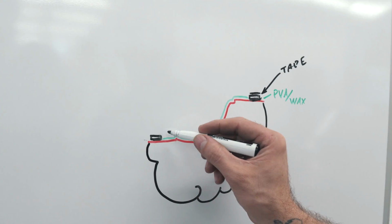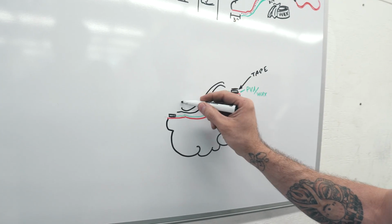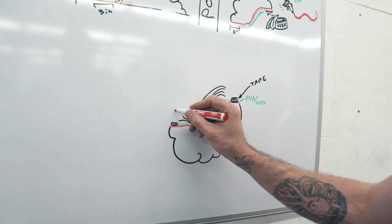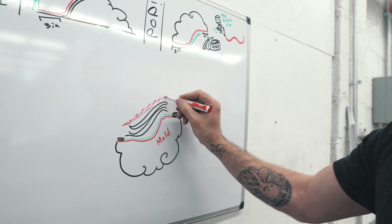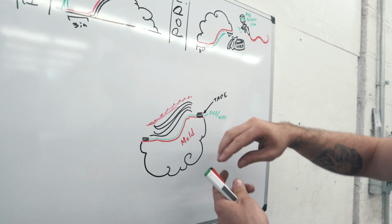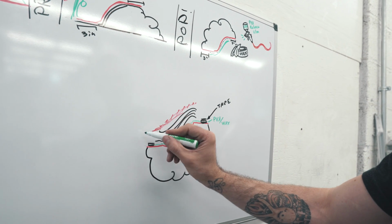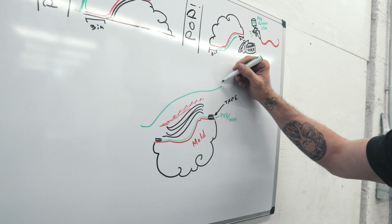And so what you do then is you would lay your 4 layers of carbon fiber in here, right? And then you'd throw in a layer of this mesh-like stuff. Is that little hexagon shape? Yeah. No, not that stuff. This mesh stuff just creates a barrier between your 4 layers of carbon fiber and what the last layer then would be, vacuum bagging film.